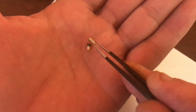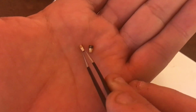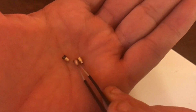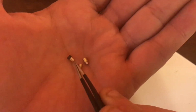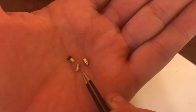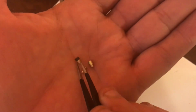Because if you don't, they're going to come out like this, where you see they've got a little bit of a kind of cone tapering to them. Now, I mean, you could obviously go with that as the pin if that's what you want it to do. But to get it nice and level, you're going to want to go back and kind of look at them. So, run your file a little bit, stop it, get the pin stopped, take a look at it and see, because you may be actually, even though you think you're filing level, you can see what I did was I had more pressure being applied to the outside of the pin than to the inside, and that gave it that kind of coning. And you may find that you were actually the opposite, and you apply slightly more pressure on the inside of it than the outside, in which case it's going to cone the other way.